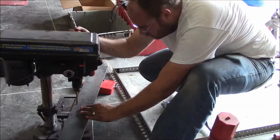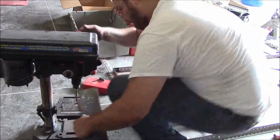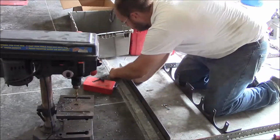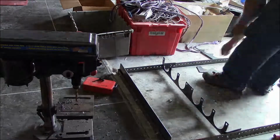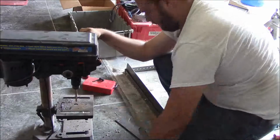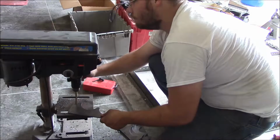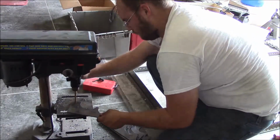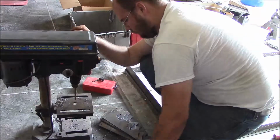Alright, now would be about the right time to talk about some of the screw-ups on this project. Drilling these holes, that was no problem whatsoever. The top and the bottom here was pretty straightforward. But what you may have noticed in the other brackets that I cut out on the plasma table, I had pierced a couple of holes mainly to use for pilots. And you'll see right here I'm just doing the top hole only, and that's because the spacing between the two holes doesn't quite mesh up with the spacing that you find on the angle brackets that I got.